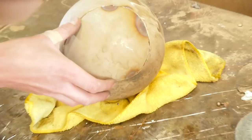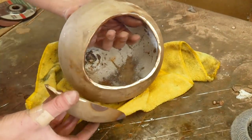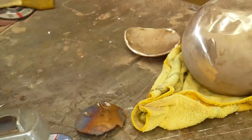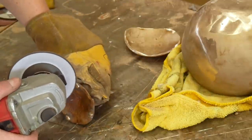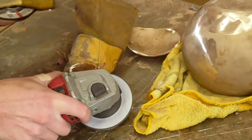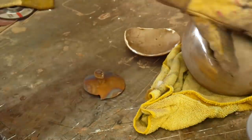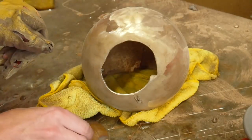Here's the first chance I get to see my previous efforts, checking the fit to rejoin the pieces. They match up with relative ease. It's the same process with the isolated balloon knot — grinding the sprue nubs off to check the fitment. In part 1, I spent time with the wax to make sure these pieces had a tight fit and it pays off now. All I have to do is check clearance and they're ready to be welded back in with little hassle.